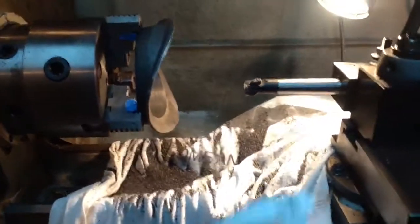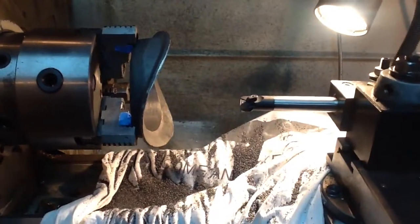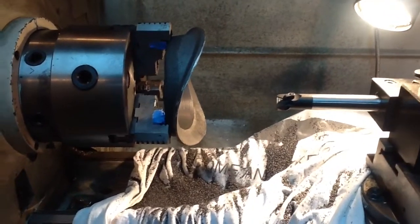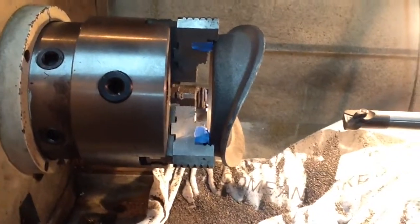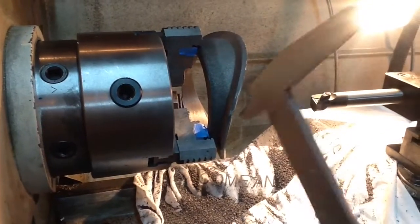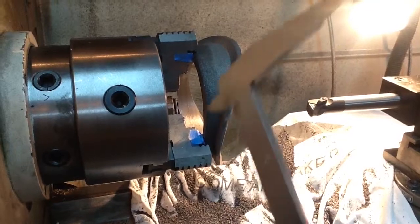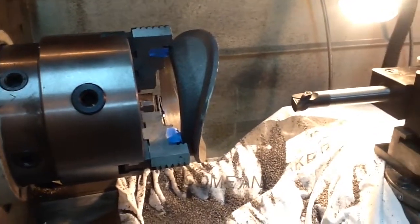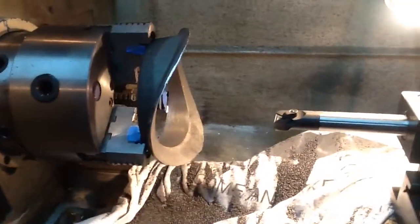I'll show it — I'm going to have to use an angle grinder and grind it out so the curvature matches exactly the outside of the boiler with the boiler jackets on, so I'll have to show that at a later date. But you can get a view of the inside here. What I used was, I taped some small brass rectangular pieces onto each of the jaws of the 3-jaw chuck, and then it held fine. Very pleased that that came out so nicely.